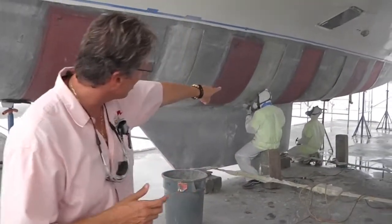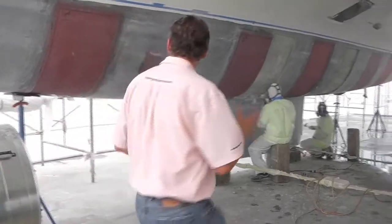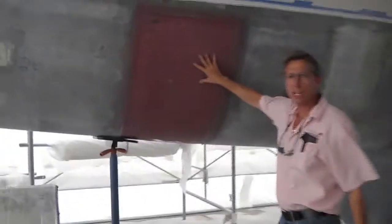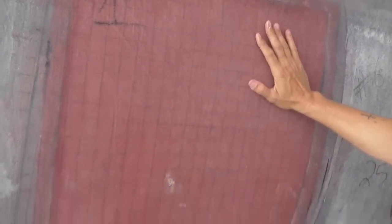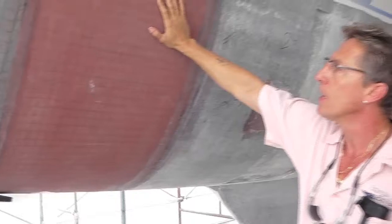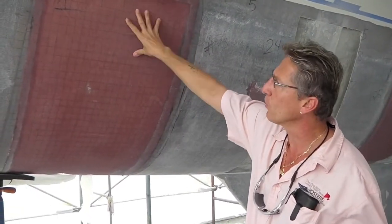And look back, you can see they're taking it out, they're prepping the inner skin to get some bonding layers. And then if you look over here, here's what it should look like when it's done. You can see it's got a nice shape, it's not really indentated. There's almost no fairing that needs to be done with this now. If you look at it, that's got all new core, all new bonding layers, and all new final laminates on